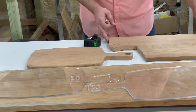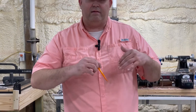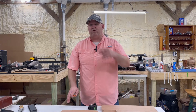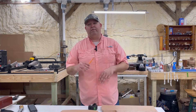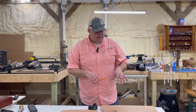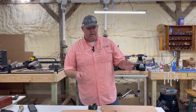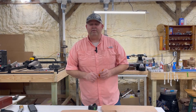What we're going to do today is take this other piece over to the bandsaw and get it cut out. Then get the template back on it, take it to the router table. We'll start lining everything up and rounding the corners over, get it sanded down, get the image lasered on there, and go through our finishing process. Stick around and let's see how it's done.